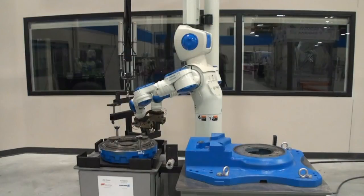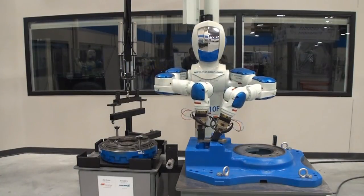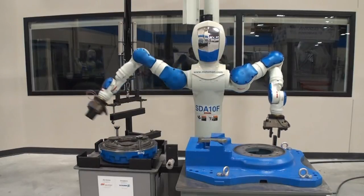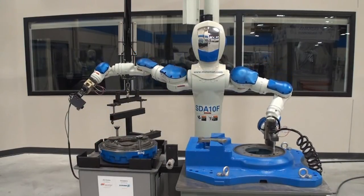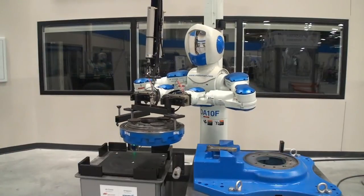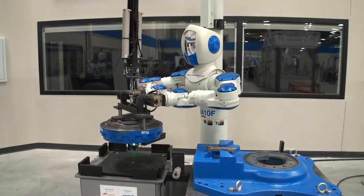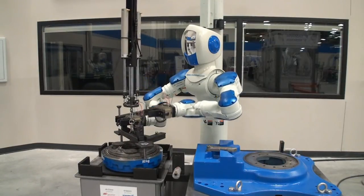The two arms can work together or independently if needed. One arm can hold a part while the other pins it in place. Here you can see two completely different operations where one arm holds a vision camera while the second one dispenses a sealant. When moving the RV drive, both arms work together, increasing the payload and providing additional stability.